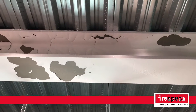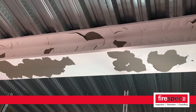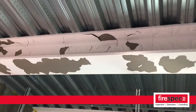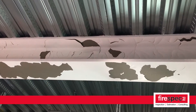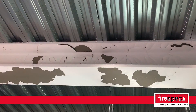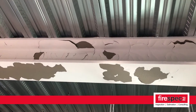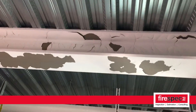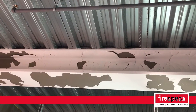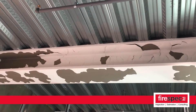Sometimes contractors don't check the conditions before they spray a particular area, so this is what happens when intumescent is applied out of spec. You have to remember that intumescent should be applied and cured in the right conditions — typically three degrees above the dew point, typically five degrees C is the steel temperature. It needs to be applied and cured in those conditions, and during the winter you don't get long periods where you can apply these intumescent coatings.